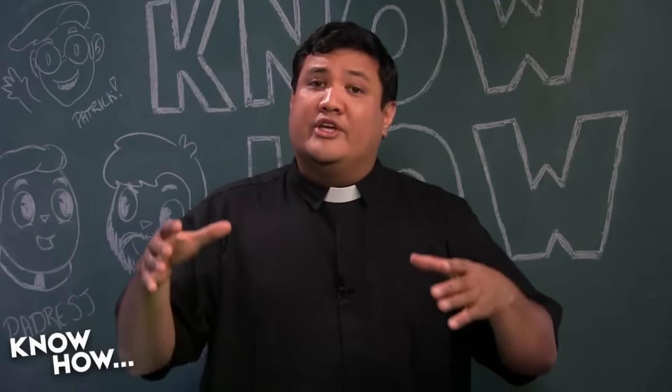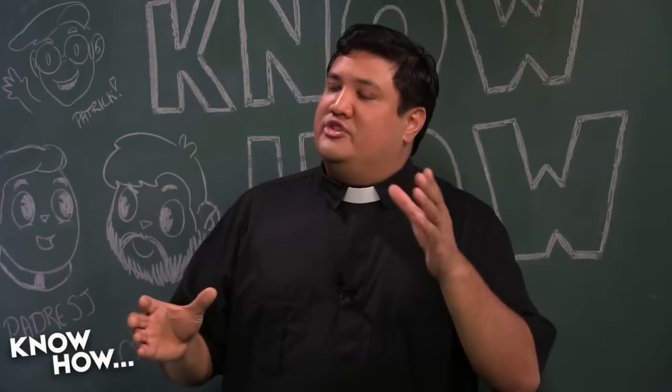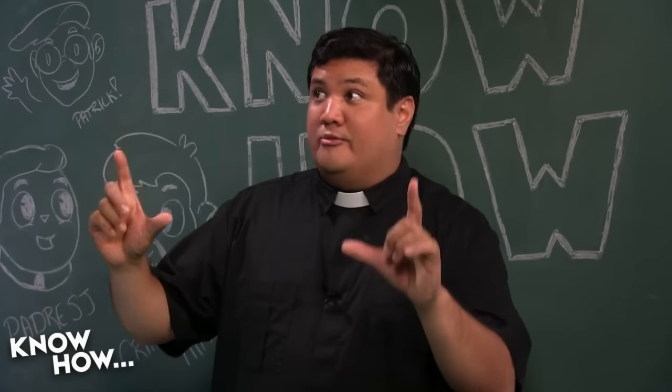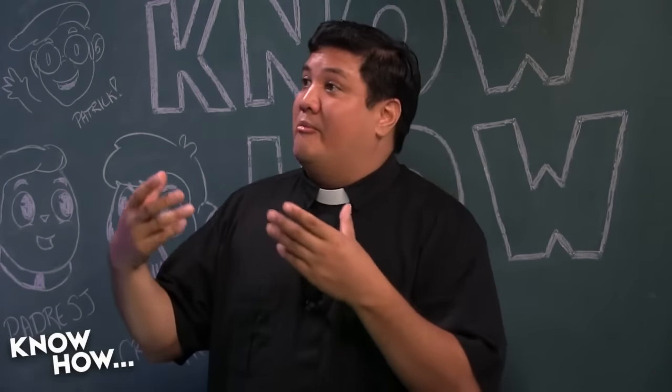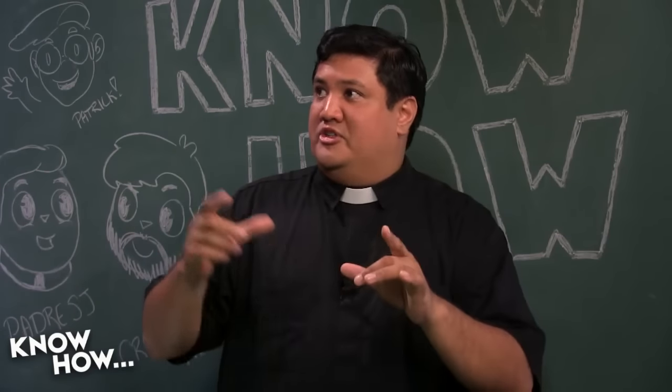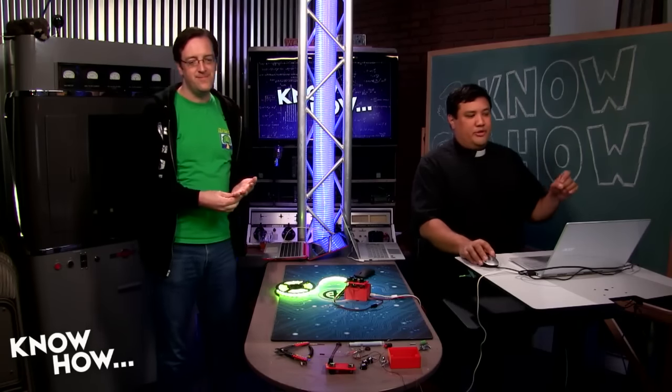But what we can do is use what we used with the steampunk goggles, and that is to map it. So we're going to tell it that between 0 and 1023, which were the minimum and the maximum values of that potentiometer, I want you to automatically do the math for me between 0 and 255. So it's reducing down to an even number. Let me show you how that works. Back to my computer...